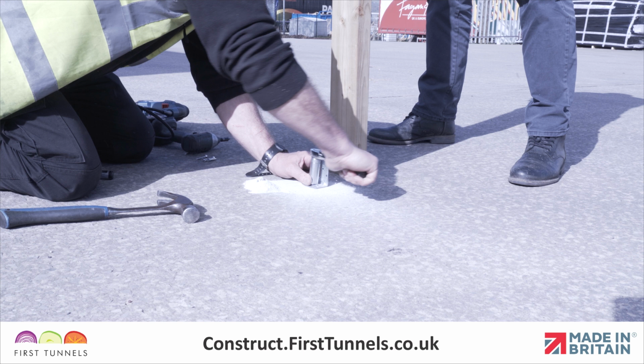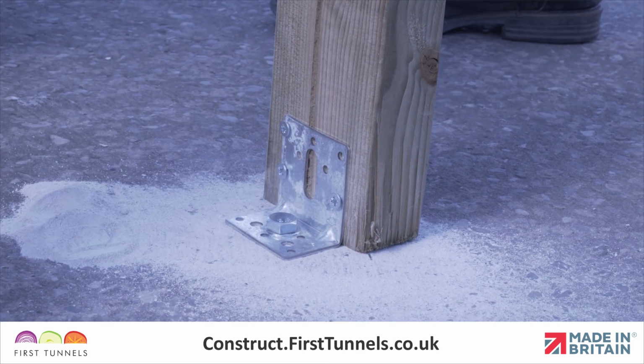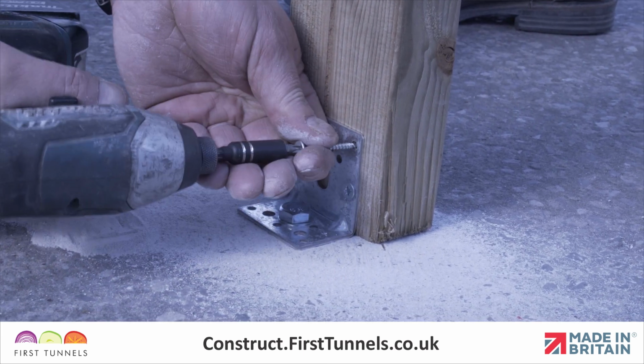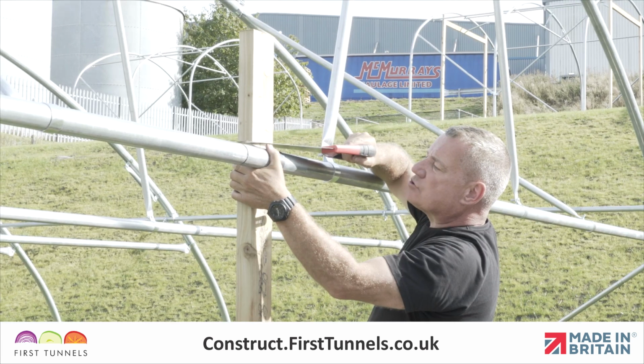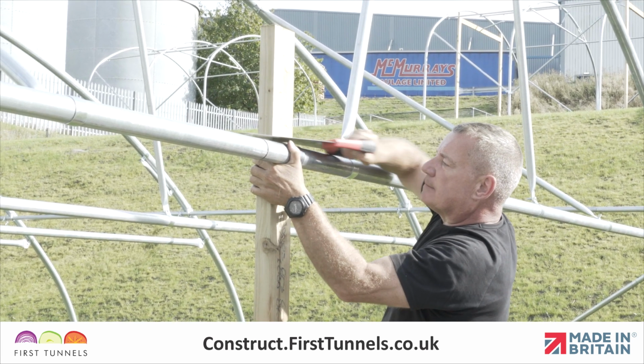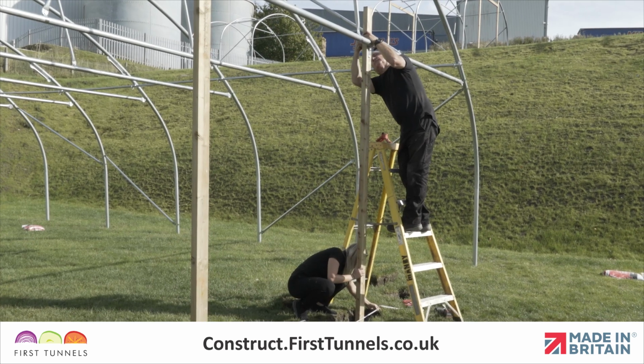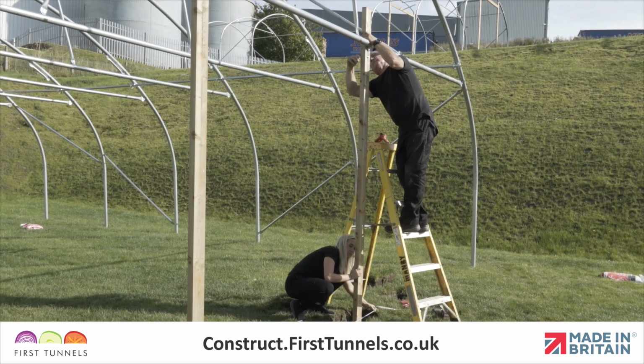If on a timber base, drill a pilot hole 7 cm deep using a 7mm timber drill bit. Finally, screw the plate to the doorpost using the screws provided. Cut off the excess of the inner door frame post in line with the top of the door rail. Repeat this process for the second inner door frame post.